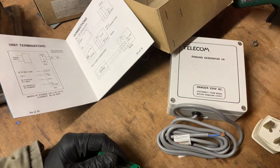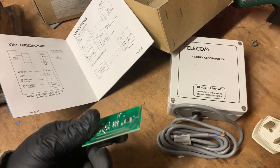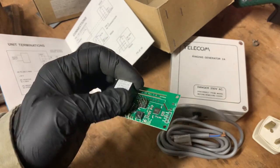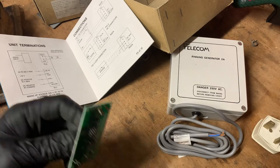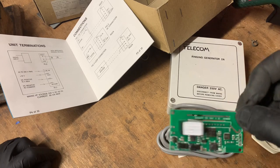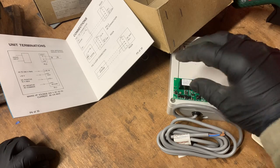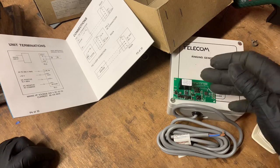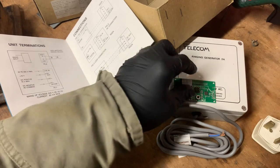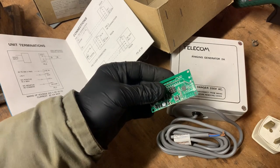I've already got one working on 12 volts in a generator — I've actually geo-fenced a generator based on this so the auto-start doesn't work if I'm not there. These are made by Sonoff; they have their own app and you can also flash them with other firmware. Something I didn't realise they had built in is a timer — an 'inching mode', designed for garage doors and shutters. Inching mode means when you switch it on, you tell the software how many seconds you want it on for. I've already set it up on my WiFi, set to three seconds.